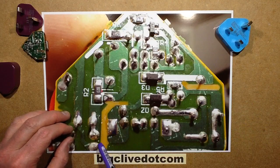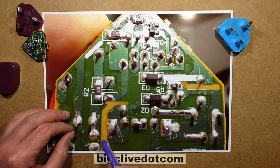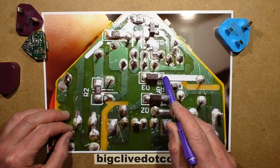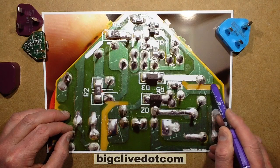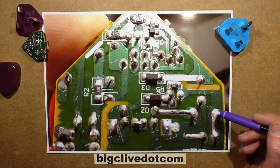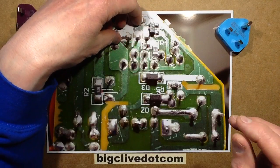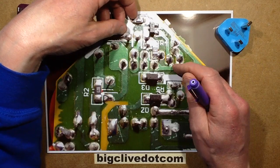Here is the isolation. Here's the low voltage section, and it's marked by this gap in the solder resist, this suspicious white silkscreen line, and then another gap in the solder resist. It's not good enough — it's only 1.5 millimetres with no actual cutout or anything like that.